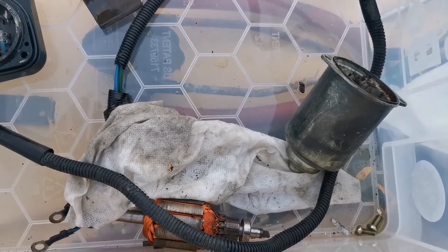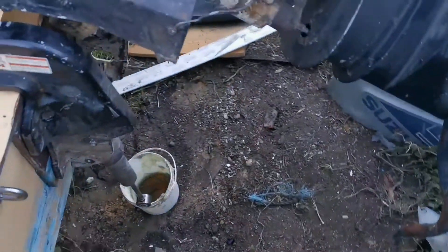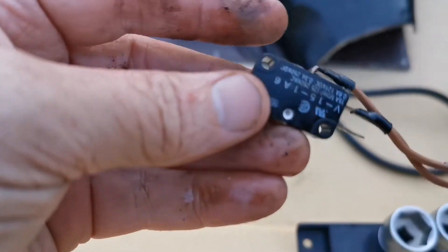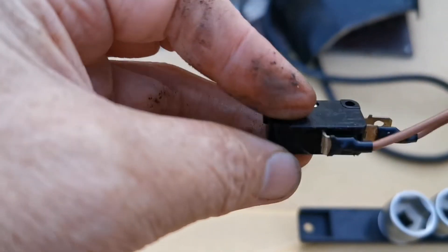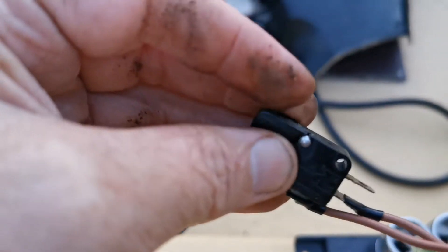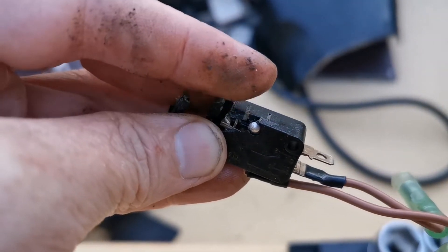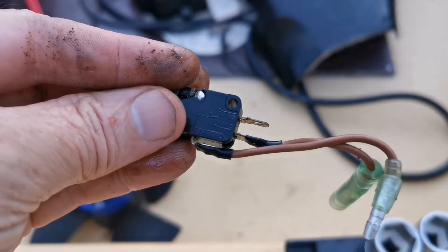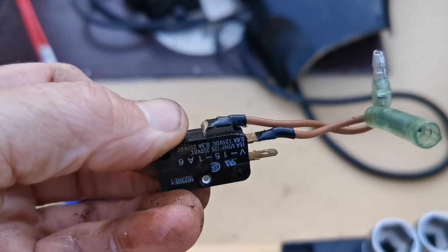I'll do it tonight so it's gone off by tomorrow. There was also something else — in the controller there's a little neutral micro switch that broke. The little things are about £23 each. It's a little push button: when the lever is in neutral position it pushes on that, makes contact, and the engine won't crank unless that's done. I've got one ordered — hopefully it'll come in a couple of days.